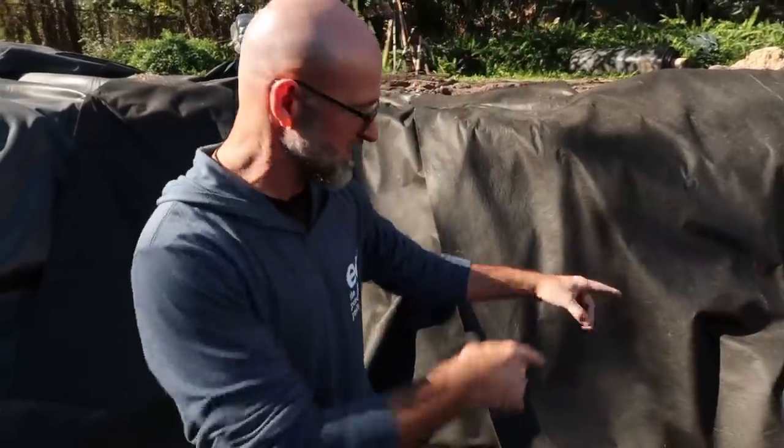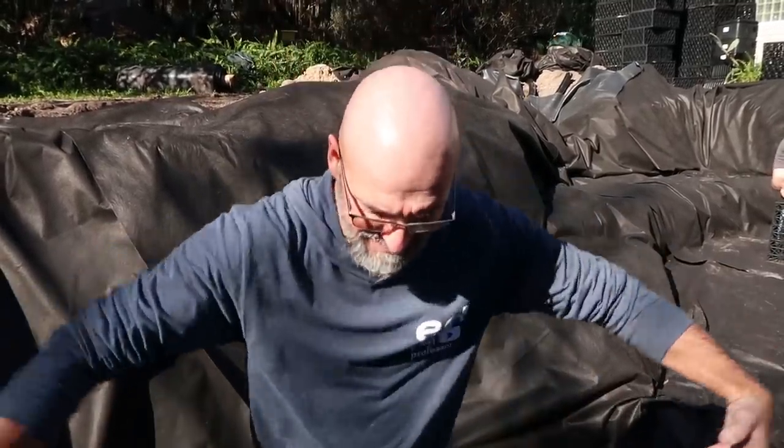The most critical area is still this deep section - we have really tall walls, water infiltrating, and unconsolidated soil conditions that keep migrating. If we get some structural wall stone down here and things start falling in, it won't get underneath anything. If things slump in, they'll push up against the wall. Once the wall is established, we'll fill the void space on top of the liner behind the wall with more crushed stone, giving us a really solid strong foundation, then continue with bigger boulders on the top edge.